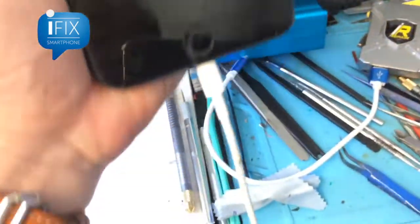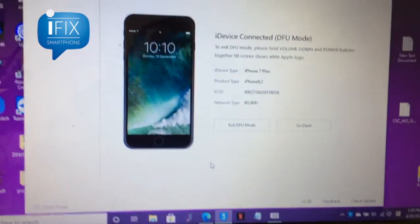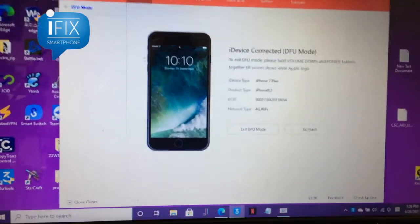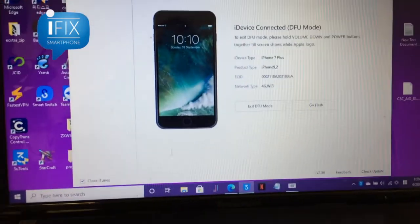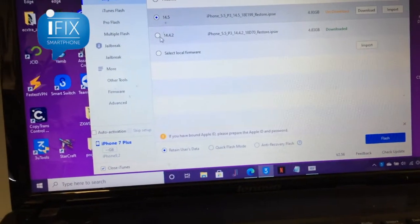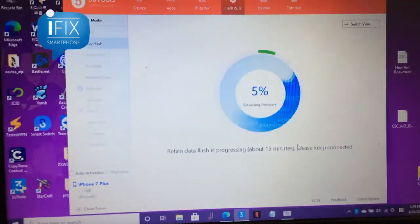The NAND is on there, so we're gonna let it cool down. The logic board is installed back into the enclosure. As soon as you replace the NAND you'll notice the phone is in DFU mode once you power it on. In order to get everything going, you have to restore the phone with whatever firmware is allowed.